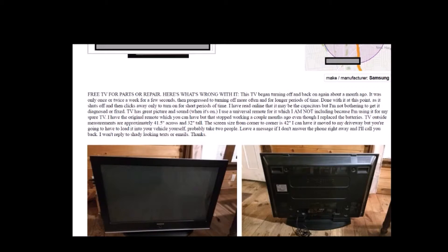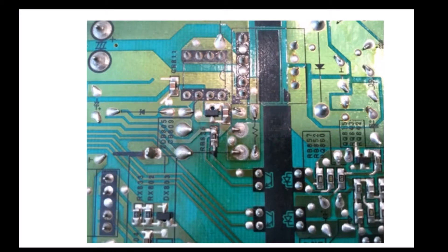And here's what I found. I did not find any bulged capacitors. I did not see any burned out components. I found three solder joints that looked questionable to me — one was this one right here, the second one was this one right here, and I did not take a picture of the third one. If my memory serves me correctly, all three of the solder joints in question were on the power supply board.